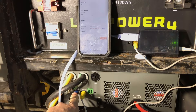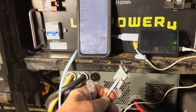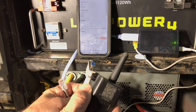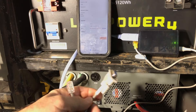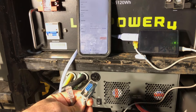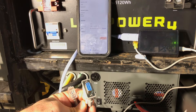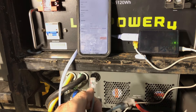What I did — and what you may have done — is bought a Raspberry Pi from Solar Assistant. You have an RJ45 port for your RS232 that you need to plug into, and you don't want to use the included DB9 to RJ45 that came with the dongle. Whatever you do, don't just plug that USB port into the Raspberry Pi — or rather, don't plug it into the RJ45 port, because a lot of those are console cables and they have different applications.